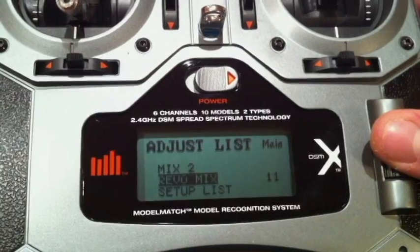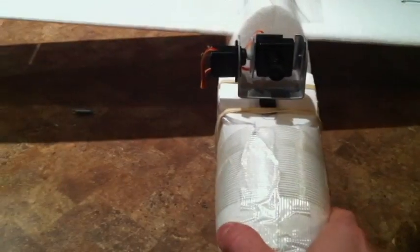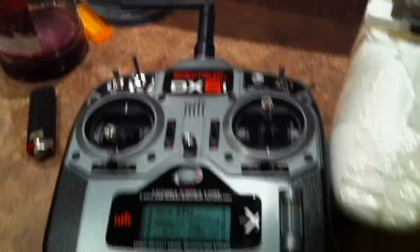Once that is done, you're good to go. You might have to mess with some sub-trims to get your camera pointing straight however you need it to. Lastly, you need to know which servo is connected to which channel: the tilt servo is connected into the auxiliary or six-channel port, and your pan servo is connected into your gear receiver port. That's all you'll need to know to get this thing working. Hope this helps you guys — have some fun with it. See ya.